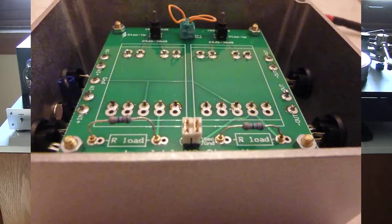The instruction manual states the Lundahl MC-SUT provides for complete flexibility with regard to grounding. For most applications, the shorting plug should be used so that the input ground (labeled primary), the output ground (labeled secondary), and the case ground — the external ground point — are tied together. If you own a tonearm that is wired to RCA plugs with a shielded-twisted signal pair and the shield connected to the tonearm ground, then you can remove the primary ground connection. If your phono preamp has real balanced inputs via XLR connectors, then you can also remove the secondary ground. Without any ground straps, however, I found the SUT provided a monophonic output. Your situation may be different.